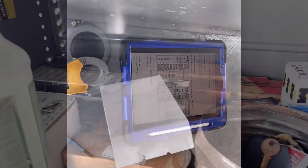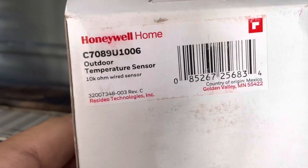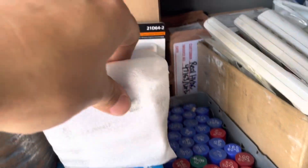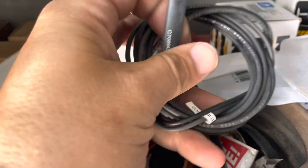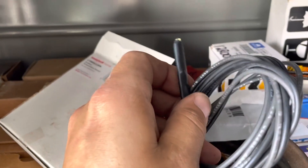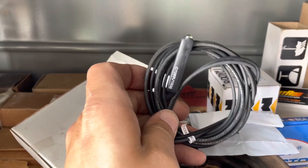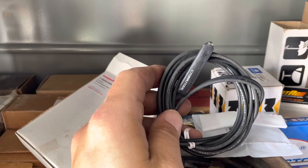Let's see about getting that other sensor out and replacing it. I don't think I have one on the truck, but let's see if I have something I can use. I do have a 10k sensor — it is for an outdoor temperature sensor and I'm wondering if it will work. If I can strap that to the pipe to get them by, if not I can probably steal the outdoor temperature sensor off the unit now and put this outdoor temperature sensor in its place.